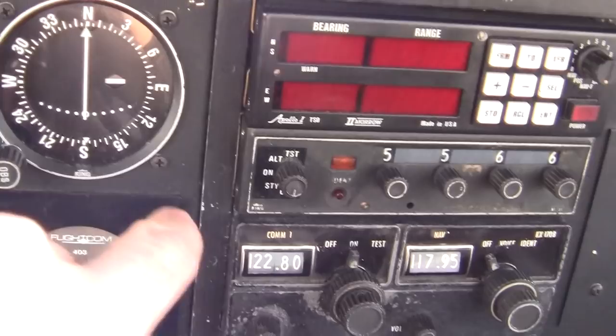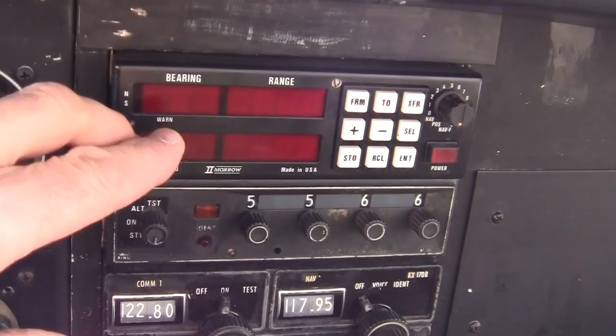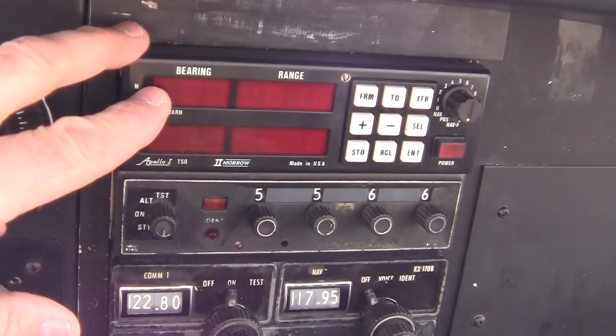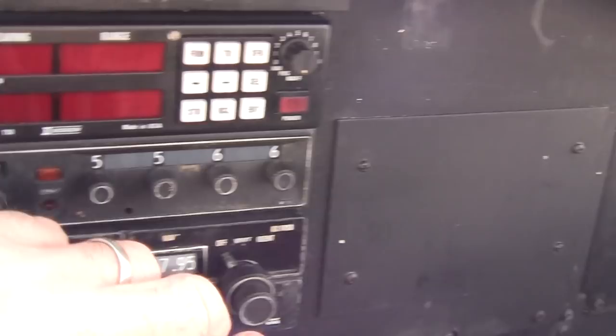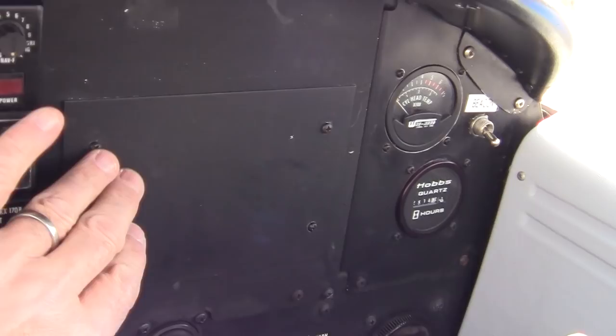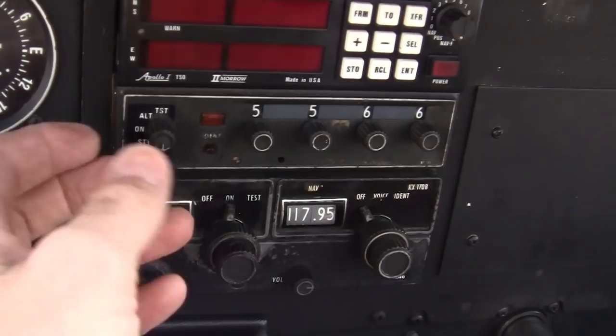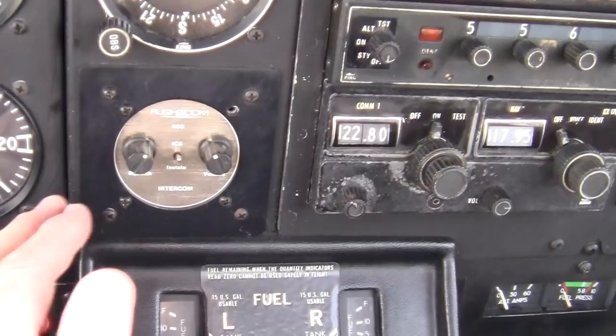And this is your VOR instrument here. This is a Loran — you can take that out if you want and maybe buy a nice flip-flop digital for this and have a second comm. That's what I would do, or at least take it out to save some weight; it's just a boat anchor. Or put a nice GPS — this is a great spot for a GPS right here. This plate here — you can either velcro on one of those Garmin 496s or it might even have enough space for an iPad, which is a sweet little thing. Here's your transponder — I usually have it in the ALT position. I don't need this here so I just leave it off, but if I'm going to Kelowna I need it.